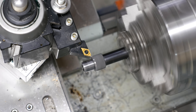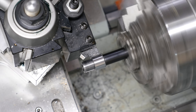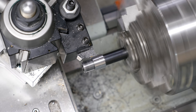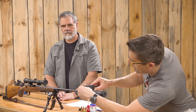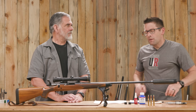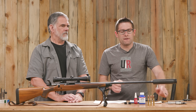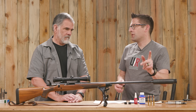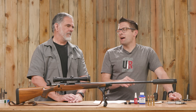We cut off the knurling and kept cutting the diameter down until the shoulder looked right. We ended up at about 0.8 inches — half a thousandth off of that — which is a really nice shoulder. It's going to give you good contact between your brake or your suppressor and the barrel. That's what we were going after. 0.8 is real close to a lot of different varmint-type barrels — right around that neighborhood — and we have just as much mass as we need here.